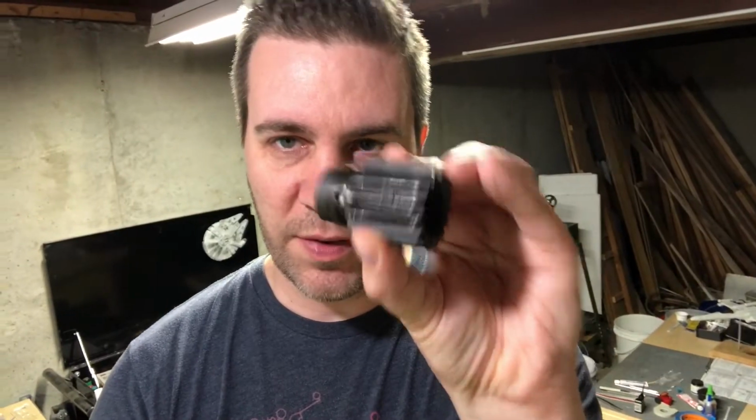And then I might polish just a tiny bit with some fine steel wool, because the bluing always takes a little bit better if the metal has just very recently been worked, like if it's not had any time to oxidize at all. I say oxidize and that's basically rust, but you can't see it, there would be even a tiny bit of surface oxidation on there. It may not be orange and very visible, but it is there. So let's just start off getting this cleaned up.